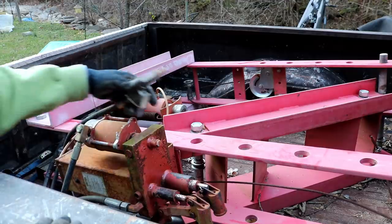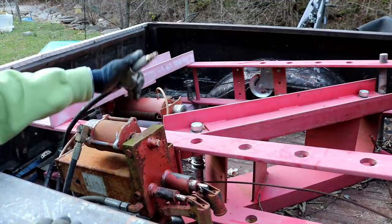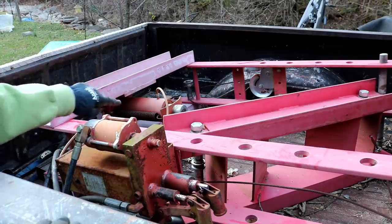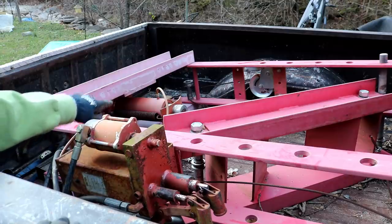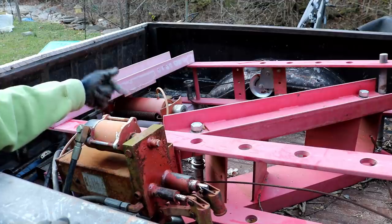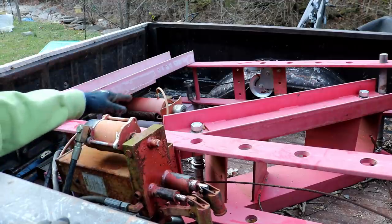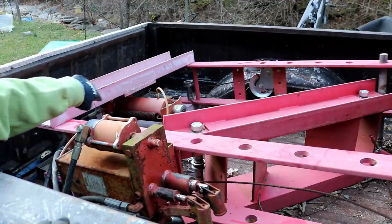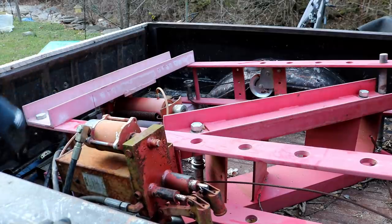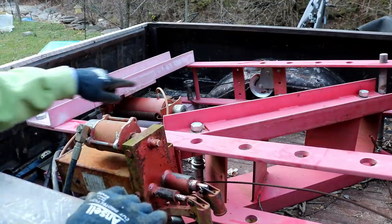And then, like I said, it is also air powered to move that ram down pretty quick. It looks like it's got probably an 8-inch throw is what I'm guessing on the ram, which appears to be probably a 5-inch OD on the body and then a 3-inch on the ram, or 2.5, something like that. Spring return. It has a pressure gauge on the other side, right? I can't show you that because you have to flip this thing over.